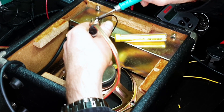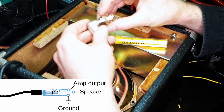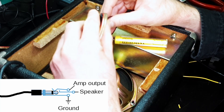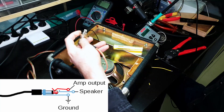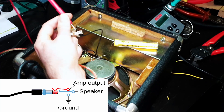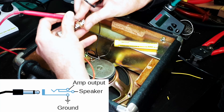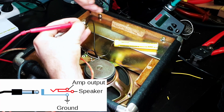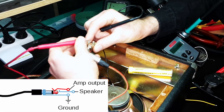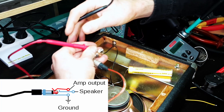It's important for the rosin to burn away the corrosion. So now there should be one lug which is not connected and one which is connected to the output. This is the one that is always connected to the output, and the other one is the one that switches. If you remove it, it still tests positive — yeah, this connects now to the speaker. Now it connects to the external speaker.